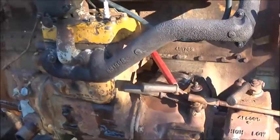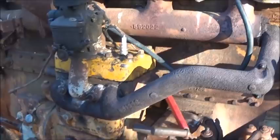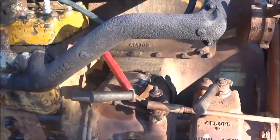pony motor is running. Does run good. No issues there. We reused the head gasket. For some reason, nobody has copper spray, and I put Indian head on it. And of course, you can see that it got hot, and that shellac gasket's shellacking. It's coming down out, but that's okay. It'll still hold. Bendix wasn't staying in, so that was temporary while I was just rolling it over.